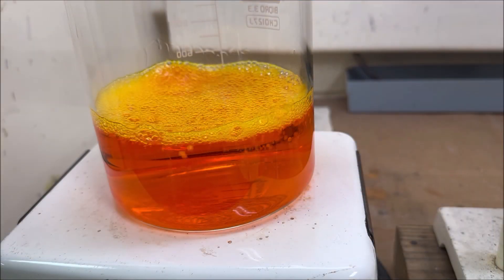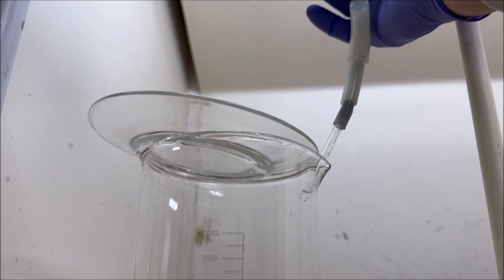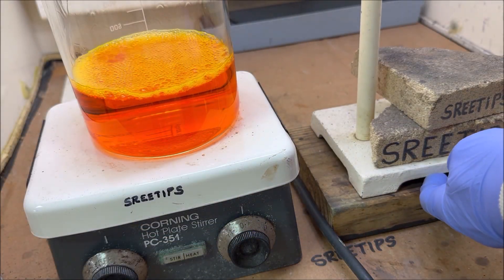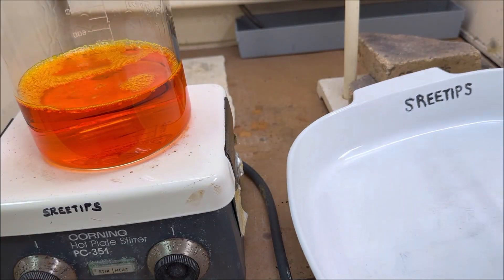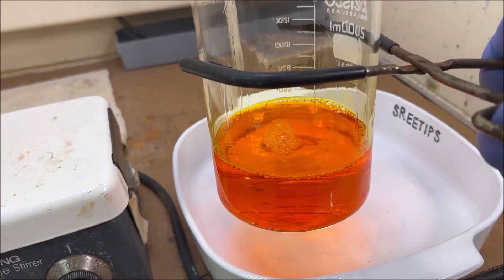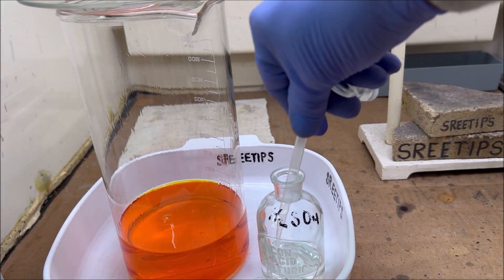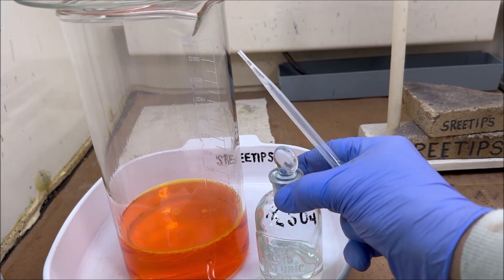That took about 45 minutes - got everything to dissolve, the solution looks beautiful. Let's turn off our spigot up here and stop the flow of hydrogen peroxide, turn the heat off, and remove our delivery device. It looks good - nice and clear, no cloudiness. Let this cool down. Before I forget, I'm going to add a little bit of sulfuric acid just to make sure - there shouldn't be any lead in here at all, but just to make sure and see what happens.